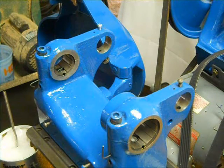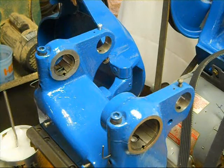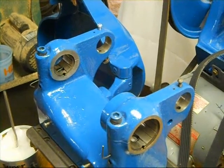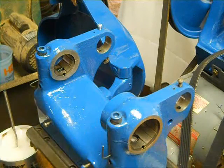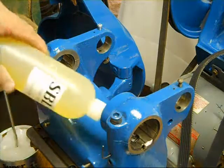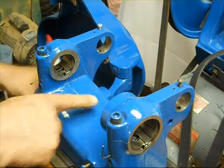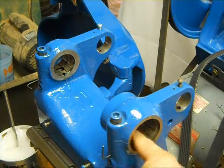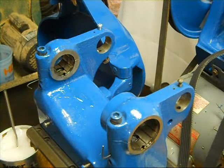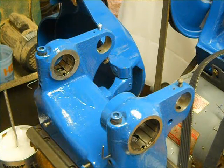Now we are ready to start putting everything together. First thing is your spindle — oh, I did forget something. I've got to put some type A spindle oil in here on the bearings. Kind of came out a little fast — I guess I cut the hole in that tip too big. That just helps everything get going smoother instead of running it and turning it dry.